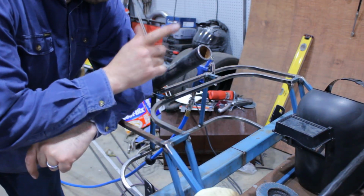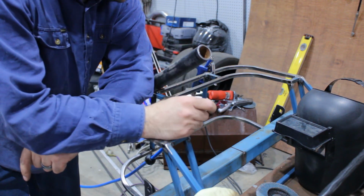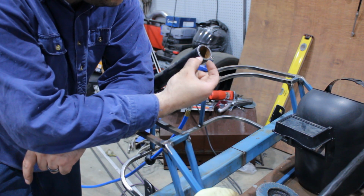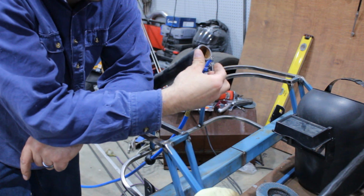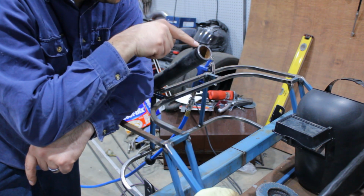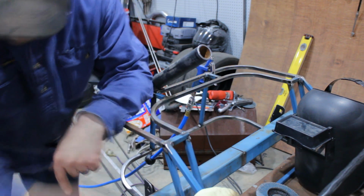So I've got this piece of 42 OD pipe. I'm just going to take a 10mm strip off the end, which is the width of the bearing. Then I'm going to weld two nuts on it and then cut it apart, so then I can put the bearing in and clamp it into place. And then once that's clamped, I'll have a standoff coming out that'll weld onto the chassis somewhere. That should support the steering. Anyway,